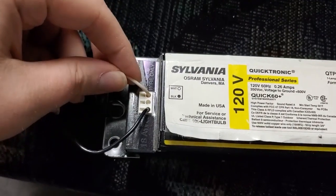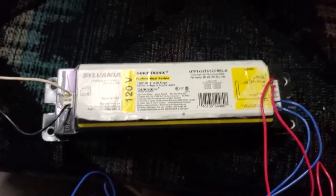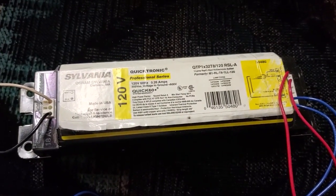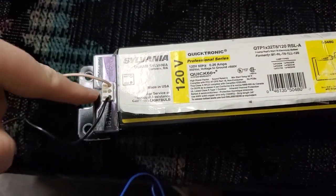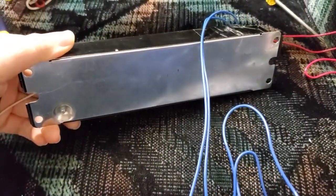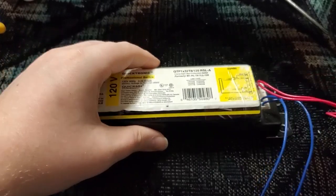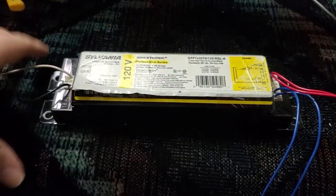You'll notice something Motorola did - they stick the wires into these little wire-grip insert things. I think the purpose was that these ballasts could be drop-in replacements for existing magnetic ballasts. You basically clip the wires at the magnetic ballast, strip those wires, and then insert them straight into the terminals. Unlike modern electronic ballasts, this ballast is in a full-size case like a magnetic ballast would come in. However, judging by the weight, it is not filled with tar - we could open this up and there's just a circuit board inside.